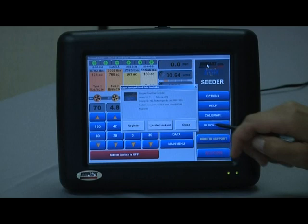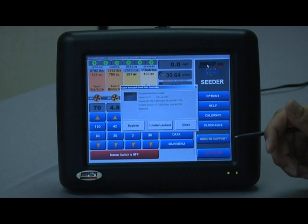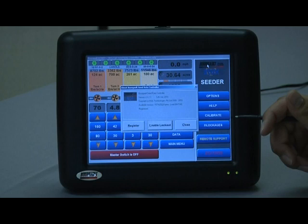Enable lockout can be used to lock out very important parameters that can directly affect machine operation — valuable in a multi-operator situation where not every operator should have access to all settings. The key is to remember or write down the password you set up, so you don't lock out the software and require a full reprogramming.